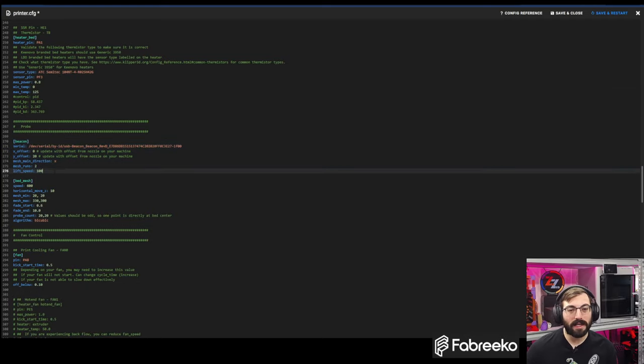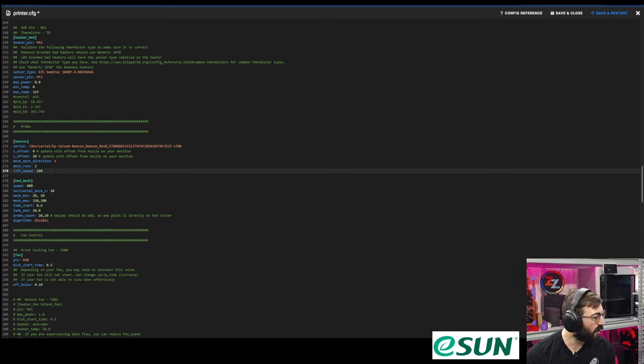We are temporarily installing Beacon. I tried to use the stock OMRON probe last stream, but it requires such a specific install and I didn't really feel like making custom cables or figuring out the config — I can't use it with an EBB36. I tried to use stock wiring but couldn't get it to work. So I took my Beacon off my other printer and put it on here. Beacon will give us a really good bed mesh before we start.